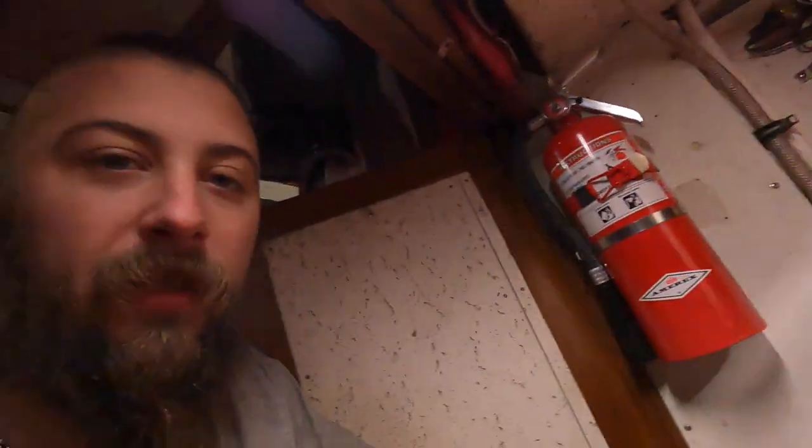All right, so one of the projects I'm working on today is the overflow valve. It has a through hull in it. You drill in the side of the boat for the overflow. The salt water runs through the system, and then it goes through the regulator, and then overflow goes over the side. The hose they put with it isn't long enough, since I center mounted this in my engine room, it isn't long enough to make it all the way to their side going under the floor and out. And I hate punching new holes in the boat.